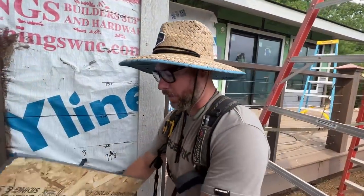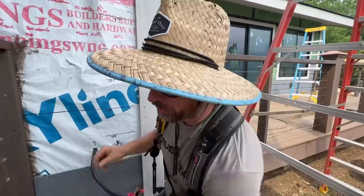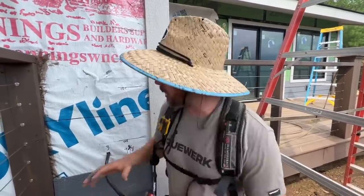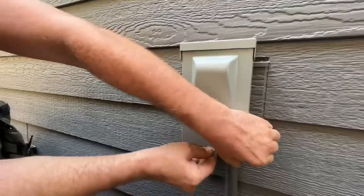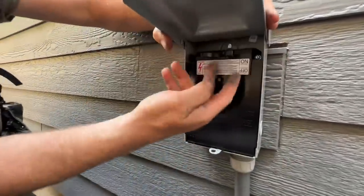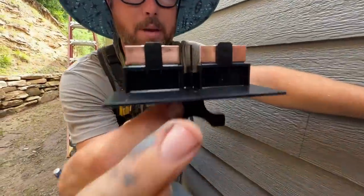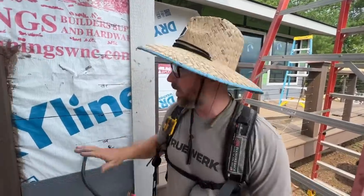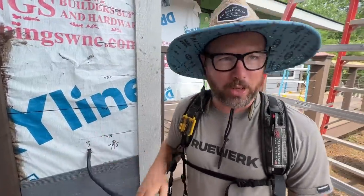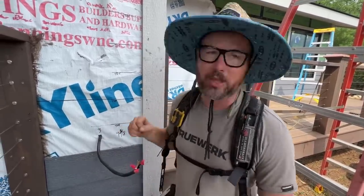Oops. So this is 220 volt, there'll be a box mounted here, which is called a disconnect, and if you're not familiar, that's so that a service person could disconnect the power with like a giant fuse. They could pull that right here in sight of the hot tub that they're working on, so that someone doesn't go inside to the panel and be like, oh, this fuse is off, or the switch is off to the hot tub, and turn it back on while he's working on it. So the guy could physically remove the part. Yeah, and you can put it in his pocket. So that he knows nobody is going to be flipping the power back on while he's working on this thing. He can just get down and work. And when he's done, put the thing back in and everybody's safe.